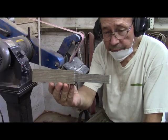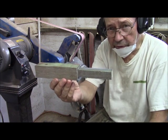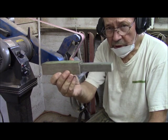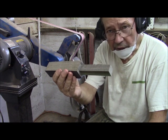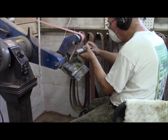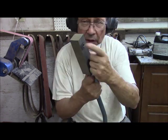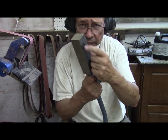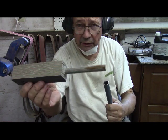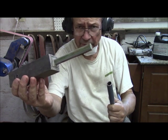We've gone on the bandsaw and cut down the shaft here that'll actually fit inside this steel tubing. And we're now going to put it on the knife making machine on the belt sander and reduce it to round so that it'll actually slide inside the steel tubing. We now have our modified connecting block fitted to the piece here, as you can see. I'm going to have to countersink for the nut head on this side and slot this, but yeah, we're very nearly there. And this is what the work looks like once it was reduced. So it's a tight slip fit.